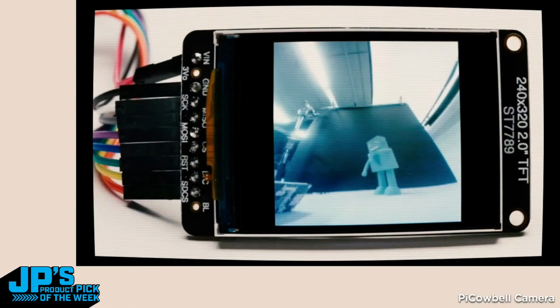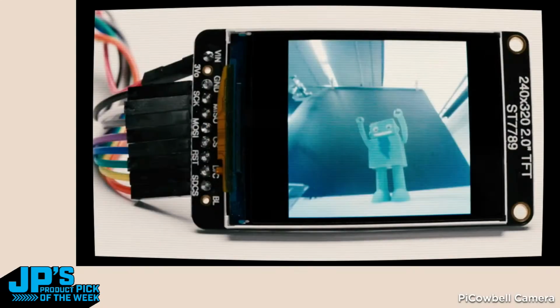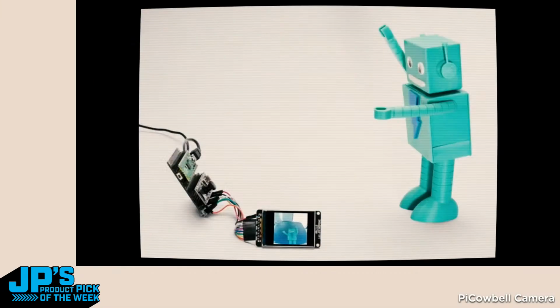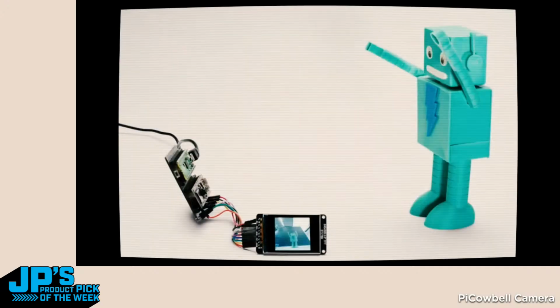And like I said, the camera module is kind of generic. You set it up, you send all these registers, and then it just streams data out in either raw RGB mode, or you can put it into JPEG mode, which is great for snapping a photo. It's compressed, and then you can save it directly to the SD card.